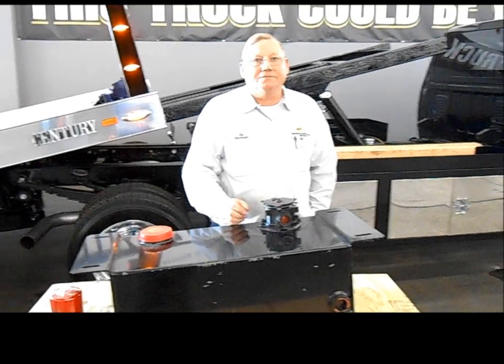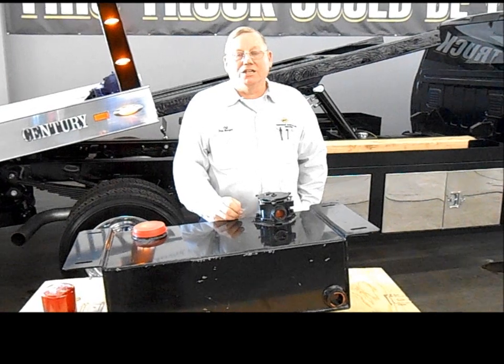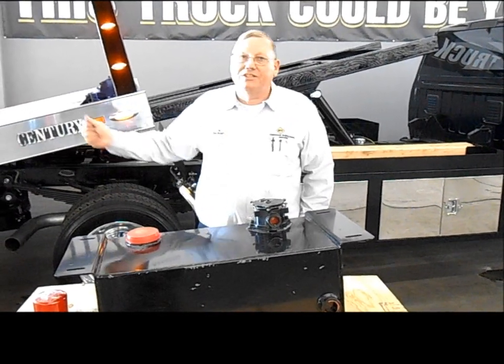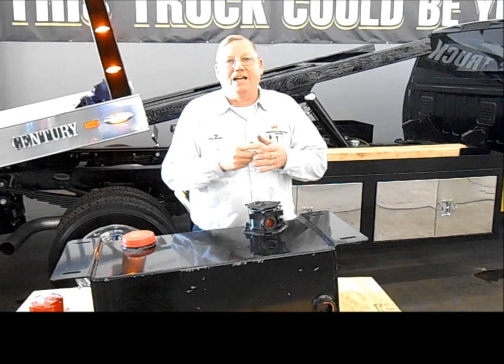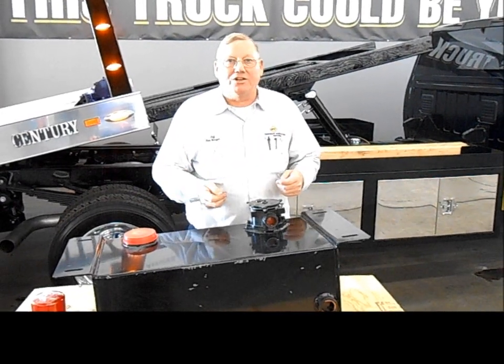So in 3 months, if you don't, could you have a stoppage of a bed, or could you have an interruption of service with the bed? You could have some major repair, because if you're replacing the valve, if a piece of metal goes through the valve, it's going to destroy the valve. The valve itself is probably about $1,200.